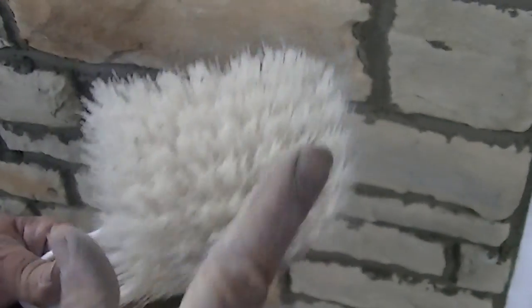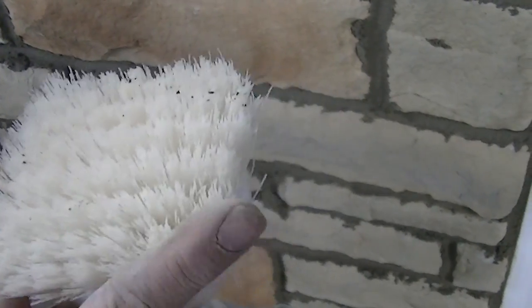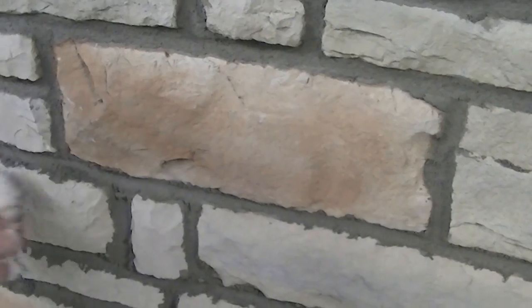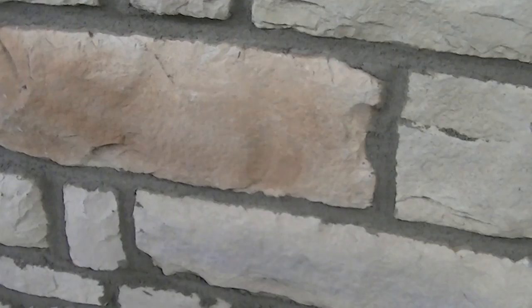Brushing the mortar joints should be done within 2 hours after tooling them. The best way to accomplish this step is with a clean whisk broom or any plastic bristled brush. Do not use a metal bristled brush. Do not let the mortar set overnight before tooling or brushing, and do not brush wet mortar as it'll smear